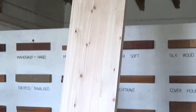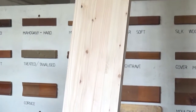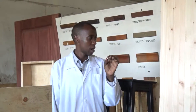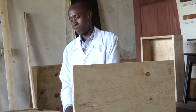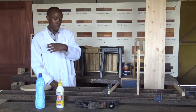Beside me here, I also have another laminated board. It is used to form a door lining. The thickness of the wall is about 280 millimeters, slightly less than one foot. We have various strips of wood laminated together and then they have been thicknessed using the machine. Once we sand the surface, it becomes very smooth — you cannot notice that there are different pieces of wood put together. So the concept of lamination comes out in very many areas in joinery. If you want to be good in producing joinery items, you have to do good lamination using good wood glue.